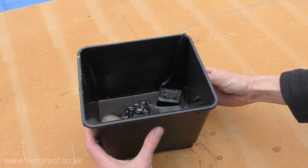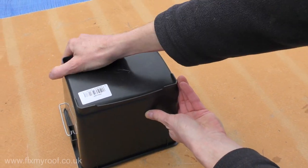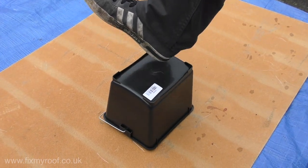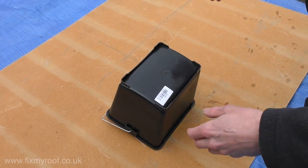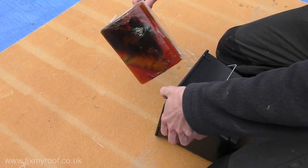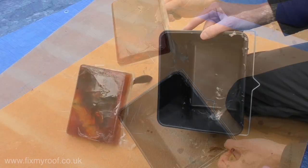After the resin has hardened off, the waste should now be one solid lump at the bottom. Turn the bucket over, place it upside down, and by applying some gentle pressure on it with your foot you should be able to pop out the waste resin — leaving your bucket nicely clean so it lives to work another day.